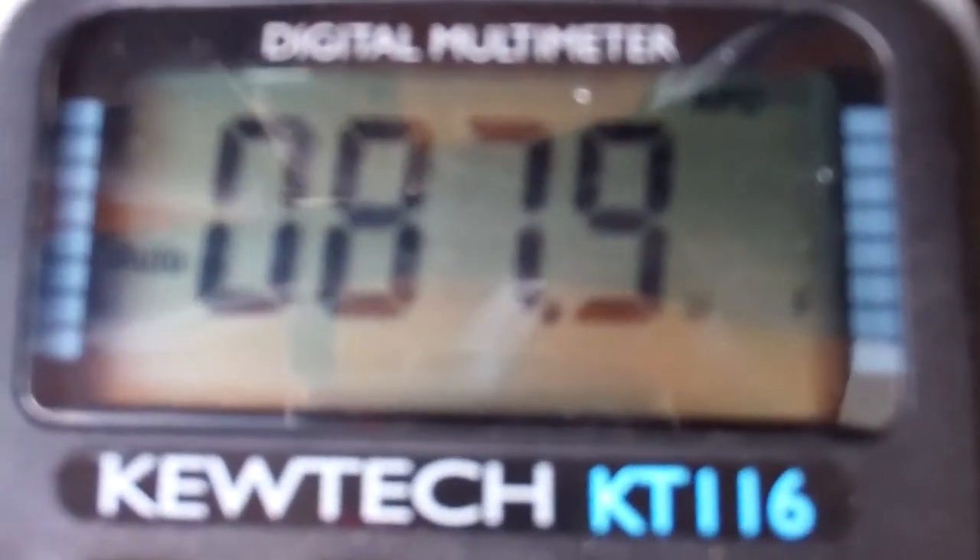And that's a 145 to 175. That's saying 88, 89. So it's not — well, I suppose it's about half of what it should be. But then you don't know what it was doing when it had power to it. And you can see it's vented there — it's blown a little hole out of that vent. So yeah, that's definitely died.